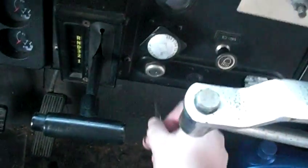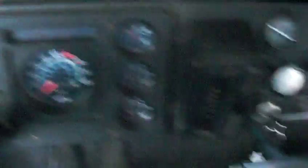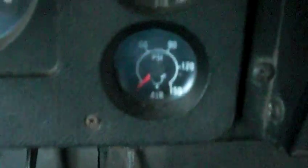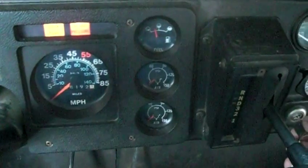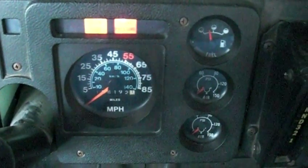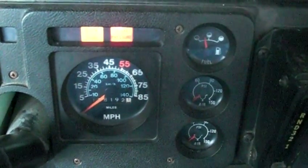There's the key, put her in. All right, now it's the first start since last night — you know how much hell it was last night. There's the pedal, I'm not pressing anything. Notice my air gauges are totally empty. Brakes on, glow plug light and brake pressure light, that's the battery or temperature light.